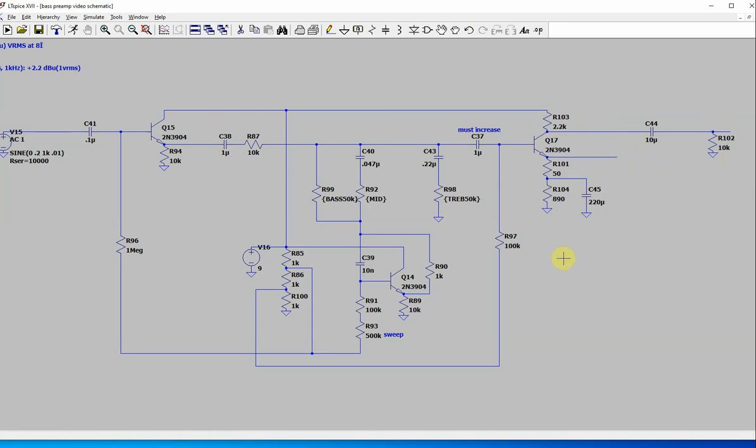So a couple changes here. First of all, this is an amp with a 1K resistor here. So the input impedance this is going to see here is 1K times the HFE, which is going to be like, for my transistors, 300K or so. So again, this is skirting things a little bit, but I'm trying to keep the circuit simple and use simple things. It works fine. Anyways, you don't want to bias this at 0.45. I'm sorry, you don't want to bias this in the middle. So I changed the circuitry here.